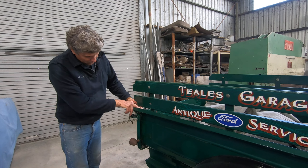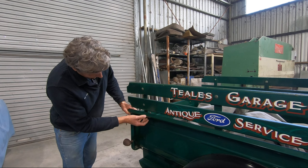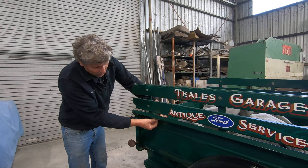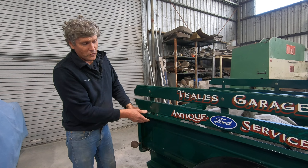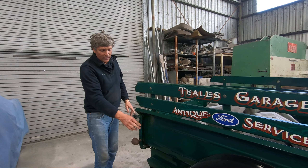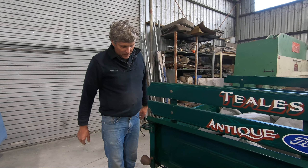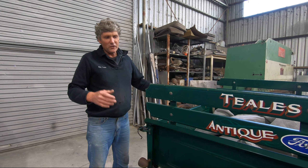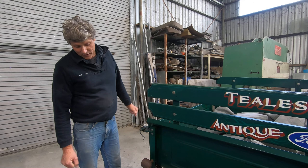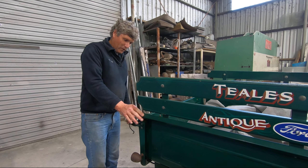This is basically just folded up and folded back on itself — it's open on the back. The original pickup rail actually folds in, comes back down and is welded and riveted along the edge to make it a lot stronger than ours. We've only got a piece of angle iron supporting the back of it, and the corners are just welded in — it's not riveted like the originals were. But like I say, it's a replica, and we made this body in 1982 or 1983, so I wasn't very old.